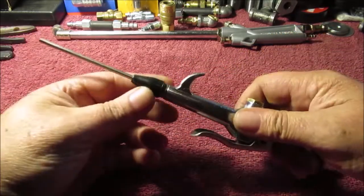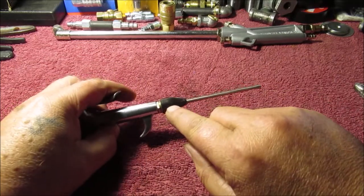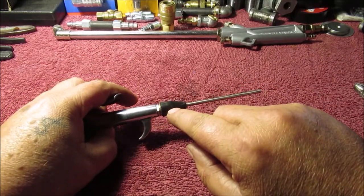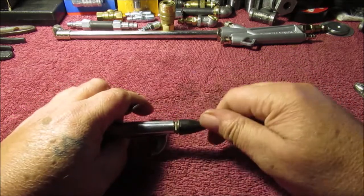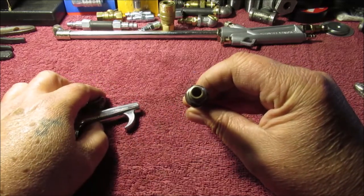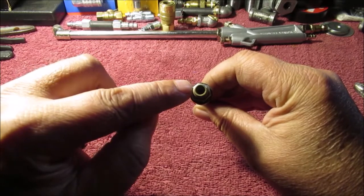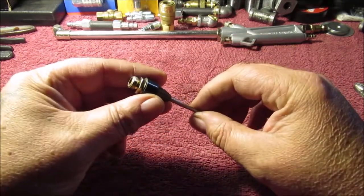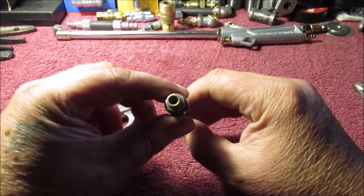with that bling. This is made just by drilling the hole. It was 2,000ths smaller than this tube, so I ground the tube a little bit and shoved it in here. And I could have flared it before I shoved it and maybe went this way. That's what I wanted to, but it would not go this direction. You would have had to shove the whole thing in there, but maybe you could drive it in more. It's not going to come out.